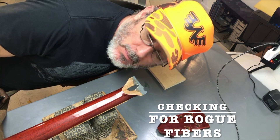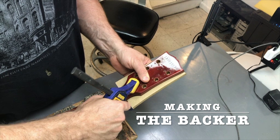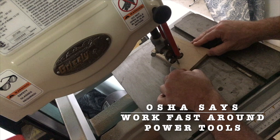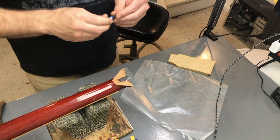Visually inspecting the joint to make sure it's ready to go back together. I want the face of the peg head to be as flat as possible — putting this backer on here is going to make sure that it's 100% flat and make my job of touching up the peg head face that much easier.